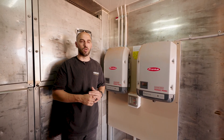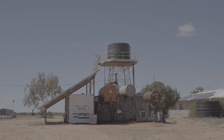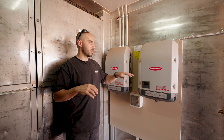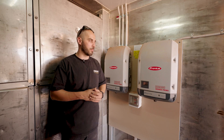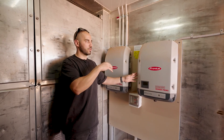That gives us awesome control. So when the generator starts — if it does start and they need that boost to charge the batteries — if there's not a lot of load and the solar is going, the solar will either ramp down or shut the AC coupled inverters off. Really handy that Victron can do that with these units.